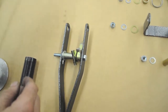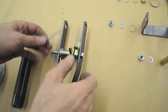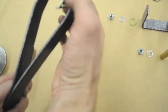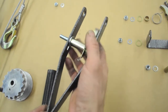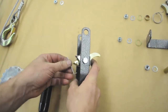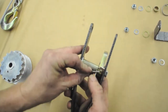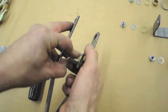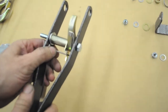Okay, now before you put the drum in, make sure you put this bent spring in here, because without the drum, the pawl has a lot of freedom to move. With the drum in there, it can only move a little bit, and this becomes much more difficult. So the spring fits underneath the edge of the washer, and then stick it in the 1/8" hole in the pawl adjuster. And again, this is easy to do without the drum in place, but once you get the drum in there, it's pretty tricky.